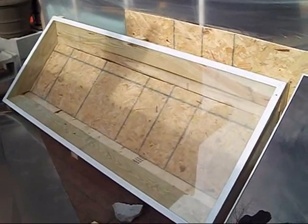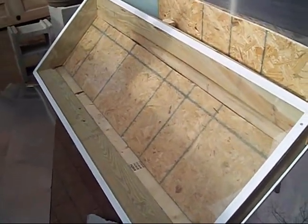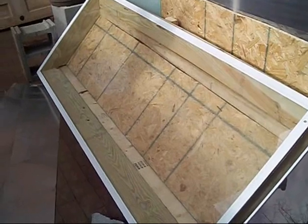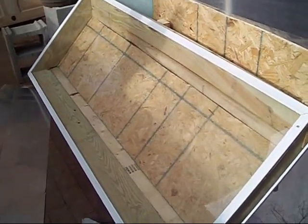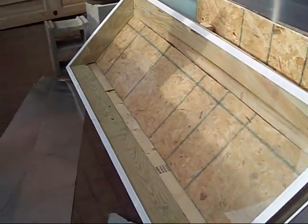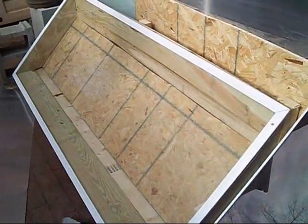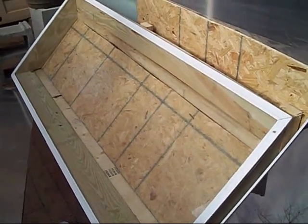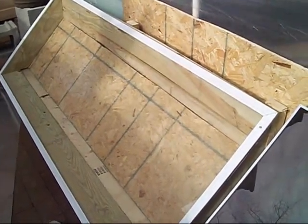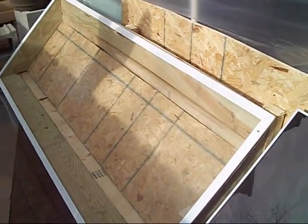Over here, I have the beginning of my solar heater. The idea is it's angled at 45 degrees to catch the sun, and when I'm done with it, I'm going to hoist it up on the cinder blocks so it actually catches the sun not only at midday but also a few hours on either side of midday. This is going to be insulated with some fiberglass I have in the greenhouse right now. I've painted one side of these boards black. Then I'll put those in, along with soda cans painted black. I also plan to put in some piping so that I can heat up water, though I've got to figure out how to turn that on and off for days when I don't actually want to heat up the water.